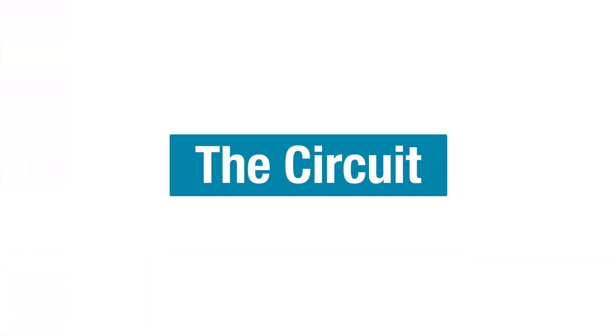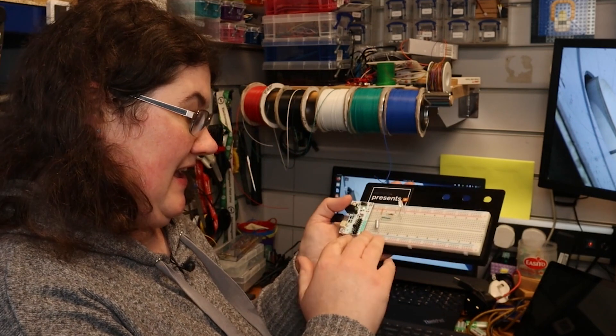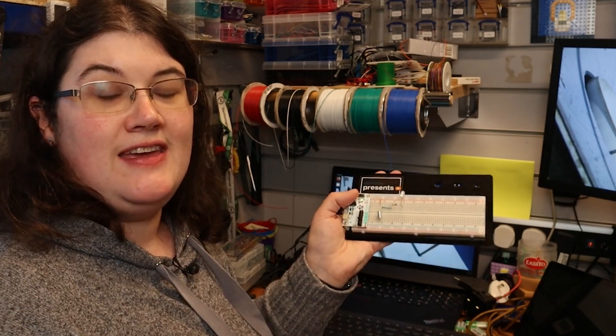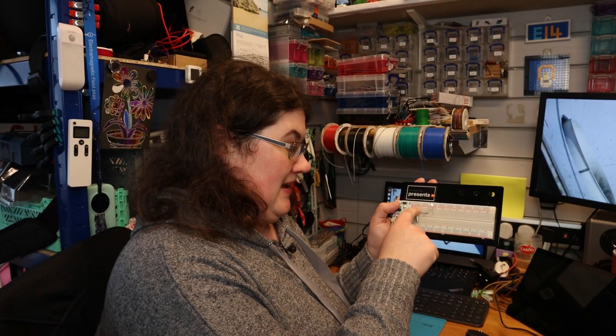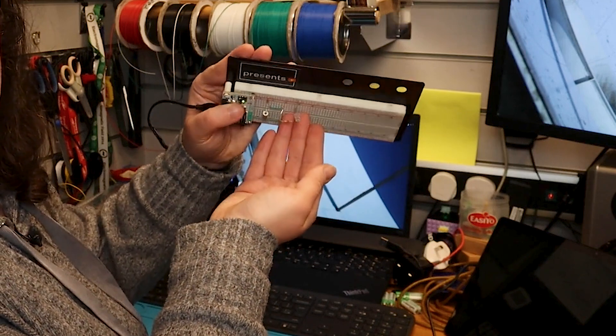I'm going to get started testing out some circuit ideas. I'm going through the tilt switch circuit first — I've just breadboarded this up. I've got a power supply set for 4.2 volts to mimic three triple-A batteries, and then I've got the tilt switch between the power and the LED. When we're looking up it's off and when looking down it's on. That's a really nice easy circuit — all I have to do is break out the wires for power to the LED, past the on/off switch.